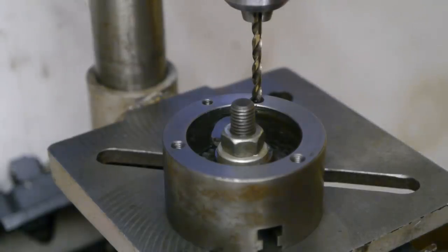As you can see, I'm going with option B. And I believe I misspoke earlier. In order to make those bolts fit from the back side of the backing plate, I would have to turn it down to 56 millimeters, not 66. So there would only be half a centimeter left on both sides of the register. And I think that would weaken the backing plate just too much.